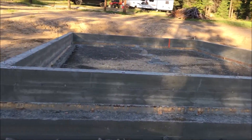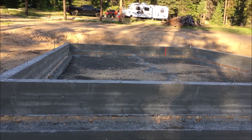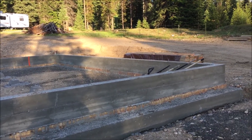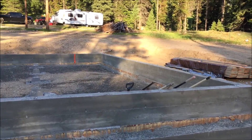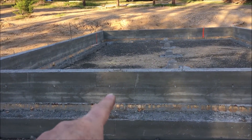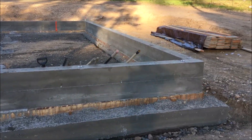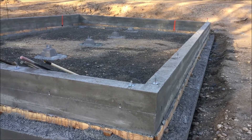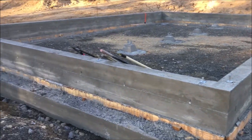We have a lot of rebar in the corners — we put three down on the footers, reinforced all the corners, and ran vertical and horizontal rebar through some of the sides where there's moisture. Just a lot of rebar reinforcing this foundation. I really like how I used the WT8 Simpson strong ties to tie the boards together for strength. During the pour, the boards didn't move at all — those WT8 strong ties with the wedges are really good for something like this.